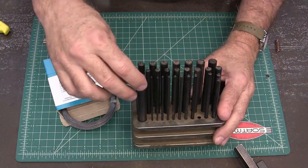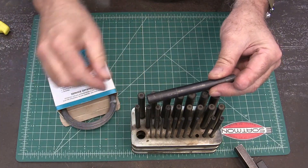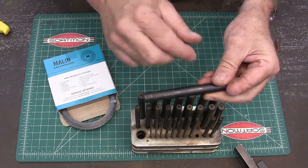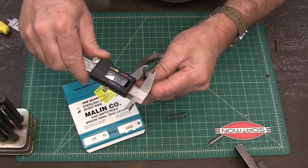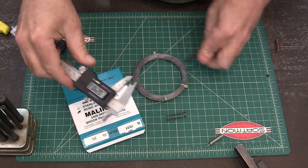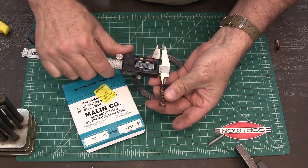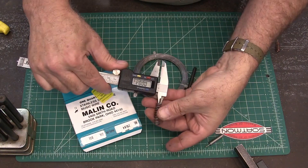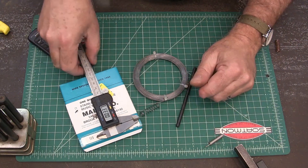These are really convenient for me, but they don't have a hole in them. A lot of people when they use a mandrel drill a hole in it and then drop the wire in there, and when you start winding it holds it for you. I'll show you how I get them started on the chuck of my lathe. For the one we're doing today the mandrel is 233 thousandths and the spring that turns comes out to be right at 300 — so it's about 70 thousandths bigger. I'll put a link to the calculator in the description in case you're interested.